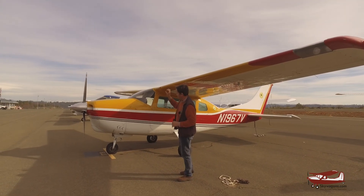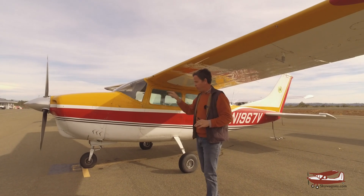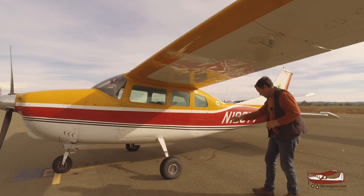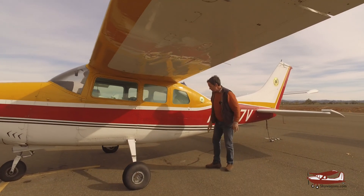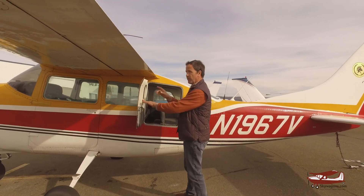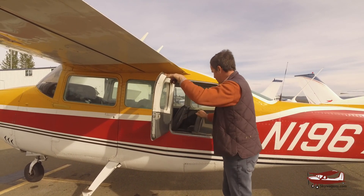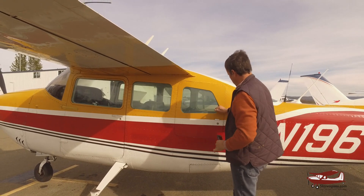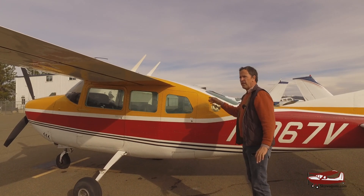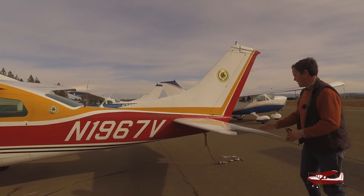The 67 still has the nose wheel chin because it's retractable, and it retains the 285-horsepower Continental IO-520 — 1,700-hour TBO non-turbo, 1,400-hour TBO if turbo. This one is non-turbo. It has similar gear doors and the same baggage door. The fuselage is very similar to the earlier models but now with strutless wings. Same six-seat configuration — two for kids in back, four for adults. This model became the Centurion, and this plane bears the Centurion logo. The tail is the same flat-skin design but now wider — noticeably wider.